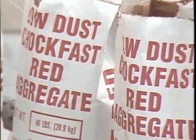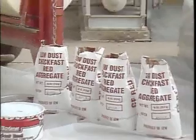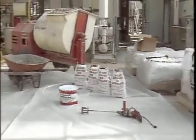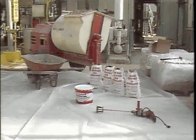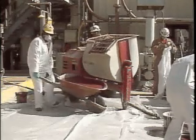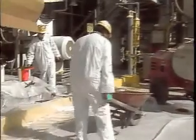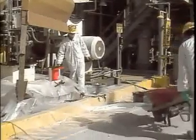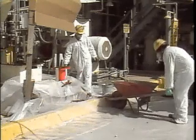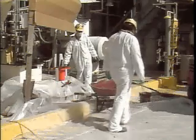Shown here is the mixing equipment and the Chockfast Red grouting material conveniently laid out and ready to be mixed. Notice the protective sheets of plastic placed around the working area. Appropriate safety equipment as required by the plant safety engineer should be worn when mixing any epoxy grouting materials. It is not necessary to use a solvent to remove any uncured Chockfast Red from mixing equipment, tools, etc., since cleanup can be accomplished using soap and water.